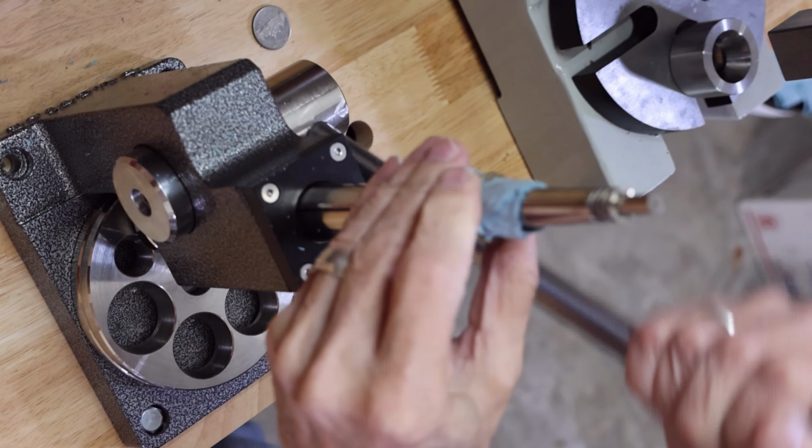Okay, so that looks quite a bit better now. Got rid of all that fire scale and nastiness. All right, so let's get the Swedish wrap out and reduce this guy down. It's about size 11 now. Reduce it down to 10 and get the sides straightened up. So I'll give this about 15 wraps probably. All right, that'll do it.